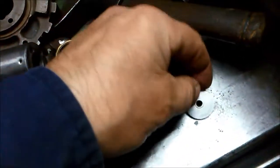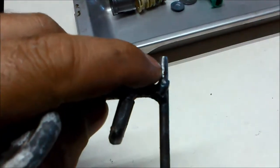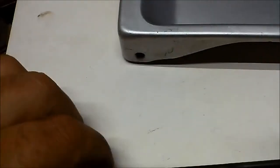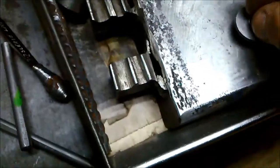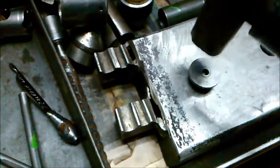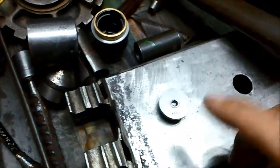Now we place this end plug just to the side of that hole and put our BATS stamp on the plug before we assemble it. Remembering that we've knocked out that little plug and straightened it — we basically just tap it in there all the way, then use this tool to pry it off. After that's been done, we put the plug back in as flat as we can and just gently tap it in. That plug actually adjusts the solenoid, so we'll adjust that after we put it all back together.